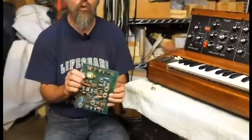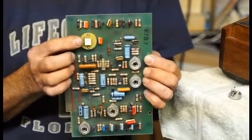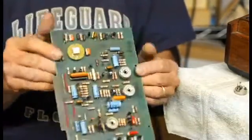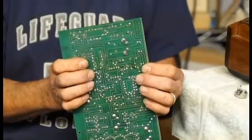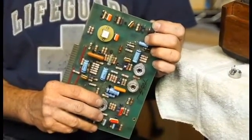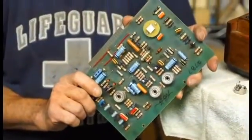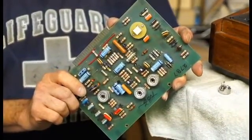We made a little adapter board so that now we can put a standard, commonly available control in place of the original pot. We simply laid out a little circuit board as an adapter board, and it has little pins, little standoffs, stakes that go into the PC board. You can see the stakes coming through the back — we solder those down, and that makes the new pot mount in the same position. Then you can tune your Mini Moog with brand new controls, have much more control over its tuning, and they tend to stay put.